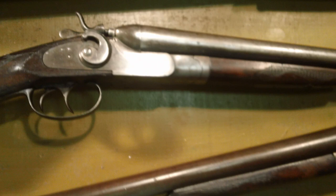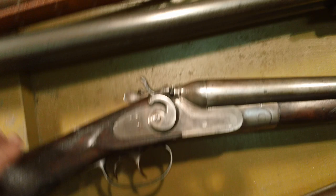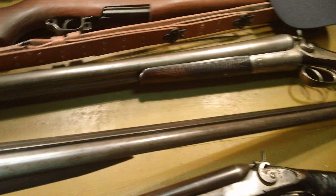This one I just picked up a few days ago. It's also American Gun Company New York — the H&D Folsom Gun Company made these under that name. This is a coil spring model, which means it's at least 1900 to 1905 somewhere in there. Fluid steel barrels — that means it's not Damascus, it was made for smokeless ammunition. It's tight, locks up tight, no wiggle. There was a crack in the stock but I fixed that with a little glue and some clamps.